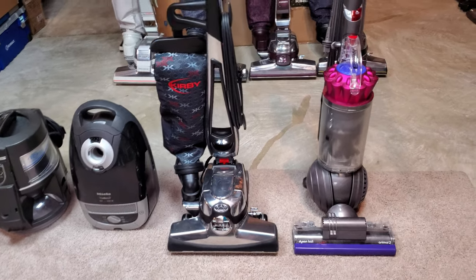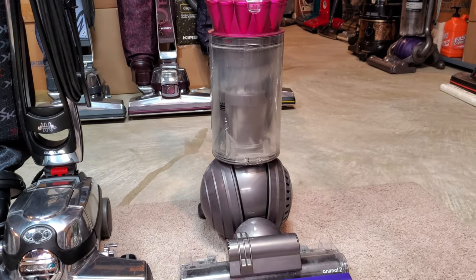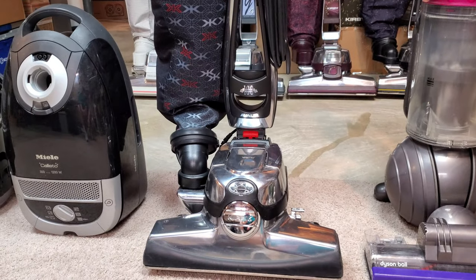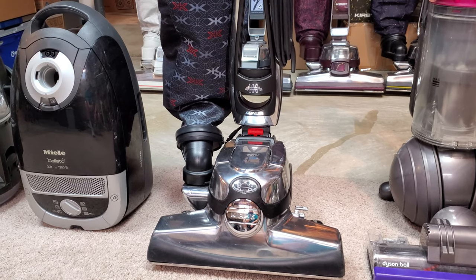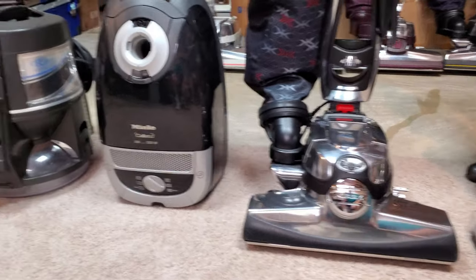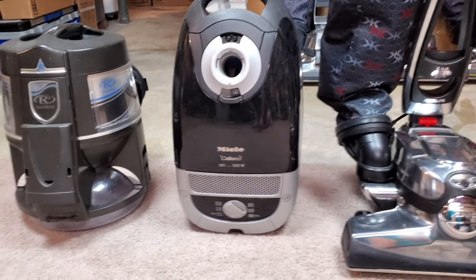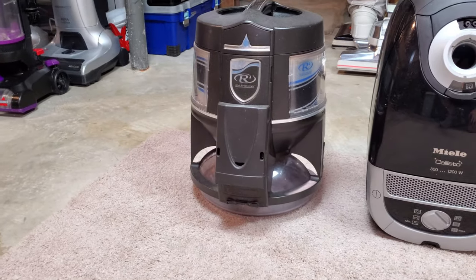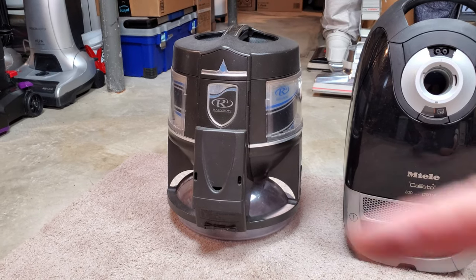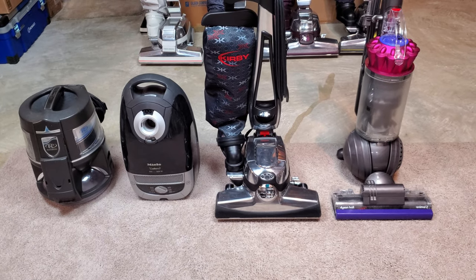To sum up, here are some modern representations of different types of vacuums. Here is a Dyson DC65 — it's a clean air machine because it is bag first, except the bag is a bin, which means it's literally plastic. Over here is an old-style machine from a technology standpoint: it uses a bag and the bag is at the back, behind the motor, so this is a direct air machine. Next, we have a modern canister — this Miele — still considered a clean air machine because the bag comes before the motor. And here's a Rainbow that neither uses paper nor plastic — it uses water — still considered a clean air machine because the filter, which is the water in the basin, comes before the motor. Hope this clears a few things up. Have fun with this quickie generalized video, and thanks for watching.